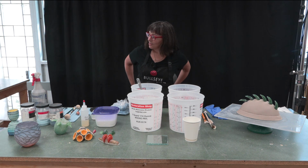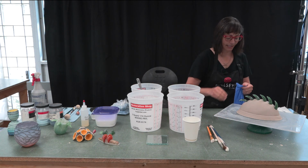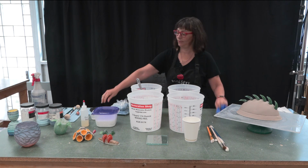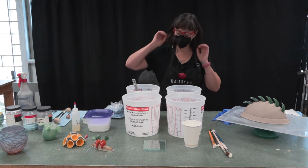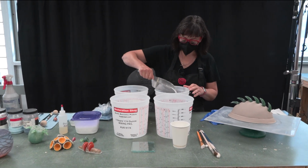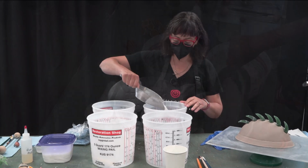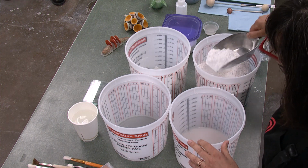So anybody who's helping, I have gloves over there for you and brushes here. I'm going to start mixing the plaster up. Mask first. So we're using a 50-50 plaster, pottery number one plaster, 200 mesh silica mix. So a refractory mold.